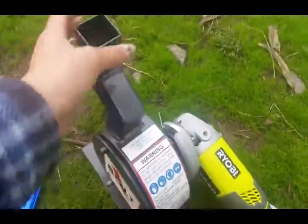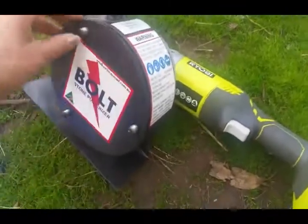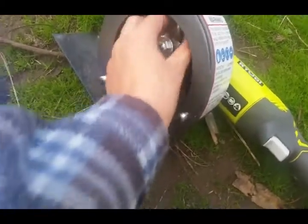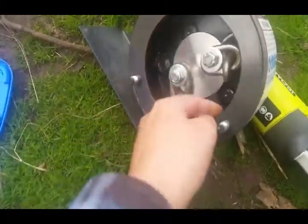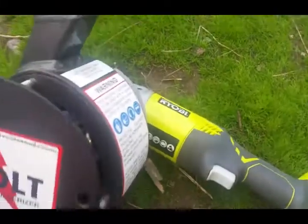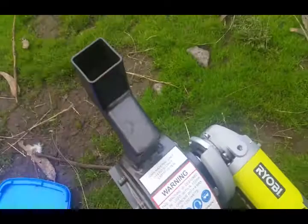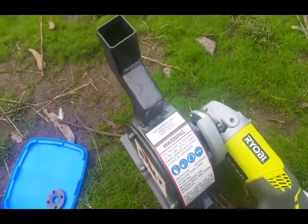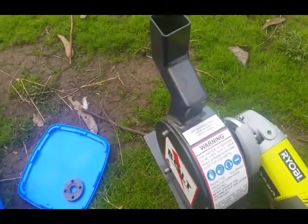All I do is connect that to my battery-operated angle grinder — sorry, listening to the birds. Just make sure you don't have the battery in it when you hook it up. Inside we have a couple of chains that spin around really quickly and smash the rocks to dust — basically that's what it is. All we'll be doing is feeding the material in through the top and giving it a gentle shake, then tip it into here and pan it off.